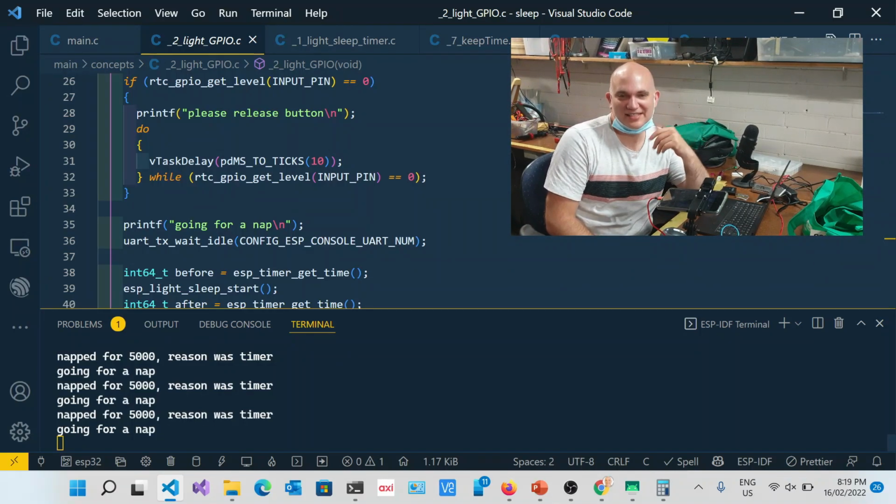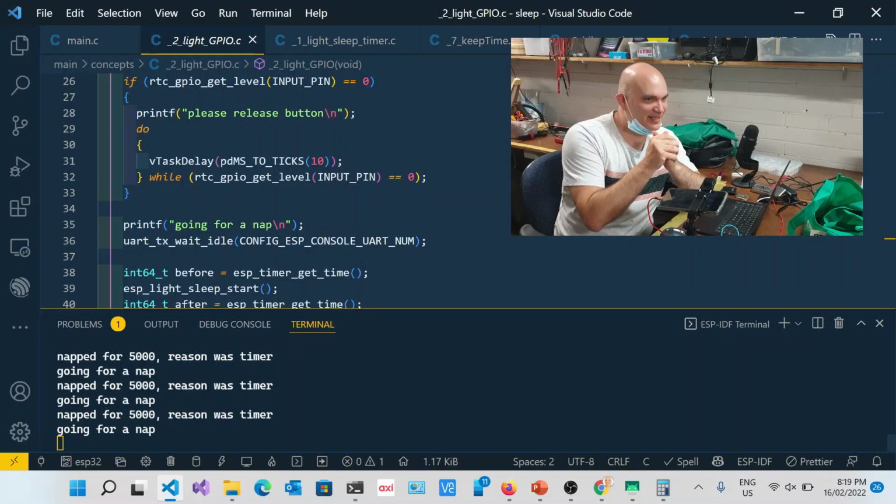Unless you use the timer, in which case you basically use something like infrared. I was thinking of also using something like a load sensor. I'm not sure if you could get a load cell that'd be light enough or sensitive enough. The trick is just to have a very reliable switch. Make sure it's a reed switch or something with good movement, not hanging on the thread.